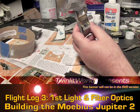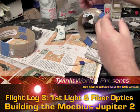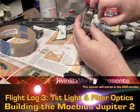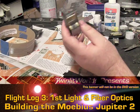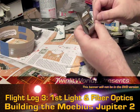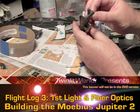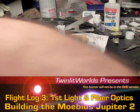One quick way to check is to simply grab some of the appropriate thread. This is 0.25 millimeter here — try it in the holes. If it fits nice and snug it'll be good. If it looks like it might be loose, try the next size up. In this case this is the 0.5 and it fits perfectly. So I'm going to drill some more out here with the 0.5 — basically I've got a lot of drilling ahead of me.